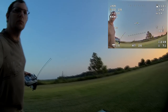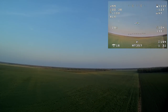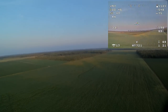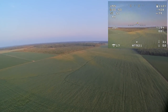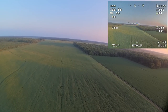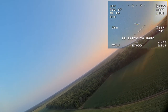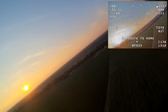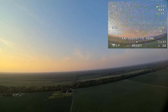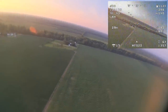This is the last flight of the day. We're launching in manual mode, then switching to air mode — basically acro with air mode enabled, which just holds the last angle you put the airplane in, no leveling, just standard gyro stabilization. Then I switch to altitude hold — AH is basically angle mode plus altitude hold. We fly out a bit and I switch over to RTH return-to-home flight mode. You can see it turns to home and immediately starts climbing, because I have it set for 400 feet. Once at that pitch angle I start losing video because of the transmitter issue, so I stopped the RTH there, satisfied it was going to return home.